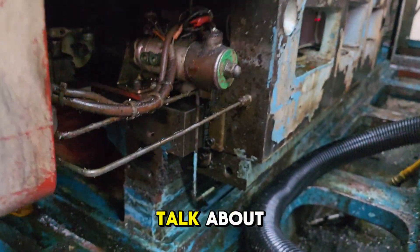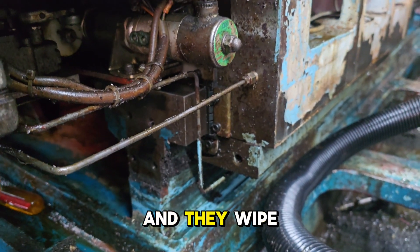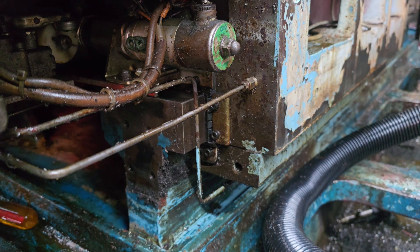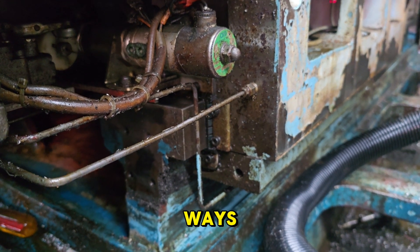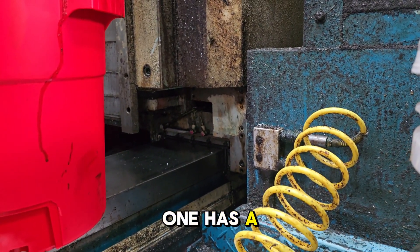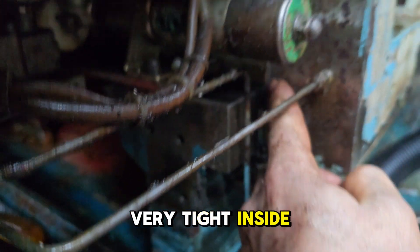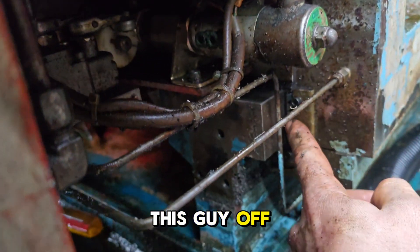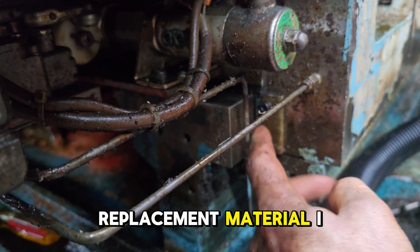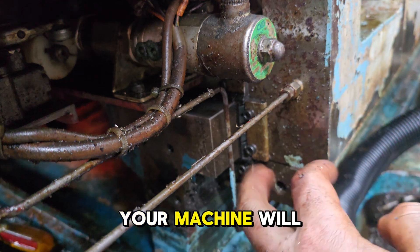We're getting to the point where it's time to talk about the wipers right here. They basically slide on the box way surface and wipe off chips and grease so they don't get into the system and wreck the ways. We've got to take these off. It's not so hard on the Z axis — that one has a lot more space. But over here it looks very tight inside, so I might have to take this off just to even get at them. We're going to take them off, try cleaning them, and see if they're damaged. If they are, I have some replacement material I can make new ones out of. Very important — keep up with your ways, otherwise your machine will wreck itself.